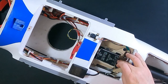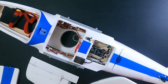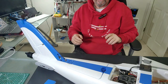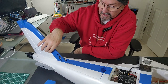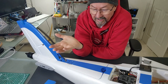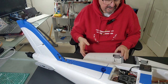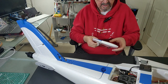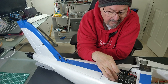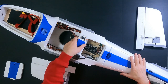So we've got ailerons, elevator, and rudder. The elevators each have their own servo, and there's a quick-release mechanism for installing the elevator — clips in quite nicely. What I found was that because of how they're mounted, the elevators moved in opposite directions, so you can't wire them with a single wire connector. The simpler answer is to run the elevators off two separate channels on the flight controller — channels 10 and 11. So there's a lot of interesting things going on in this compartment with the flight controller.